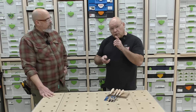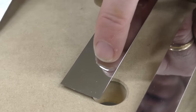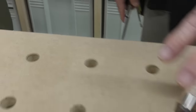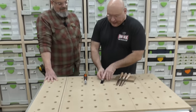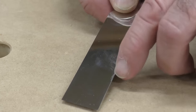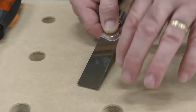The first thing you always check when you get a chisel out of the package — everybody thinks you can just take it to something and it's good. No, it's not. It's also disappointing to go to a big box store and get a chisel that's dull. You always have to hone it. But look at the backs of these Optima bench chisels — they're highly polished. You can see the reflection in them. The big box one shows machining marks. These are machine polished to a flatness of 0.0001 inches — absolutely amazing.